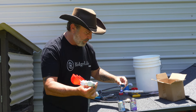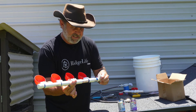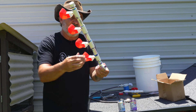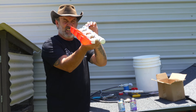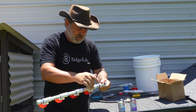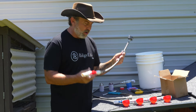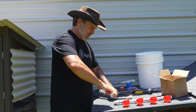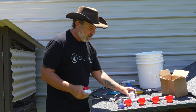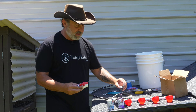Cut the straight runs — this is going to be pointed backwards. Slide it in, hold on to this pipe and turn it level. Make sure everything's still level. The last piece of glue is the part that goes up into the bucket. I already have everything pre-cut and pre-done. The last glue will be when it goes through the housing — so I'll go ahead and take these apart, get that fitting on with a little bit of glue, push in, quarter turn.